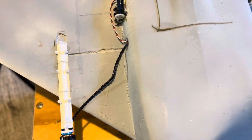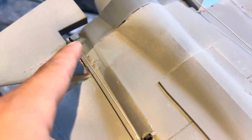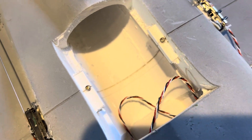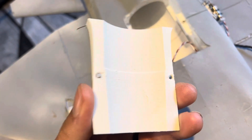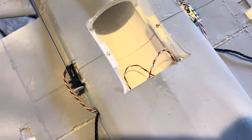Servos literally just CA right onto the side of the fuselage. There's your ball pivot right there — it just snaps right onto the 3D printed horn. And of course, here is the magnetic hatch. Little magnet slots — you just dig them out with your knife. There are little holes in the file, so when you print it, you'll have little holes here and here for the magnets and also underneath. You might need to take an X-Acto knife and dig them out a little bit deeper because the printing of the lightweight stuff is never perfect.